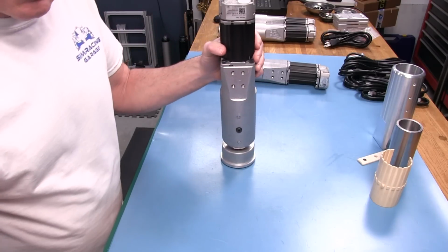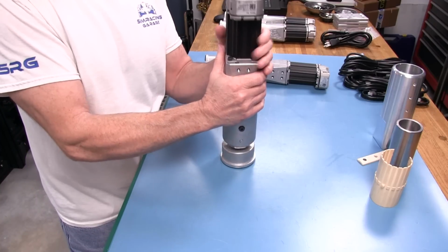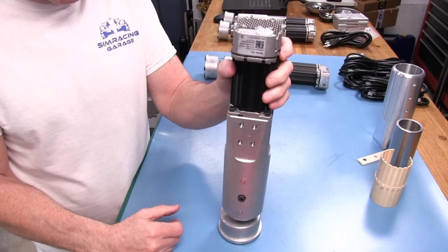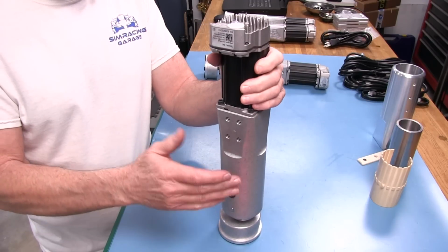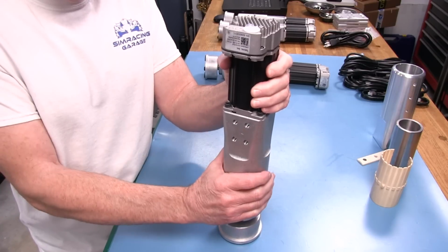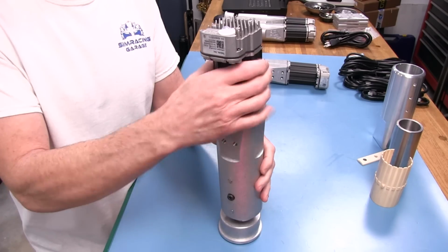The speed is directly related to the motor, so we can talk about the motor. The speed is 8.4 inches per second. That comes out to about 213 millimeters per second. So plenty of speed for a 2-inch actuator, I would say. And again, 50 millimeters on the piston itself. So I think we covered just about everything we could on the housing, or rather the housing part of the actuator. This is really the actuator. This is just the motor.